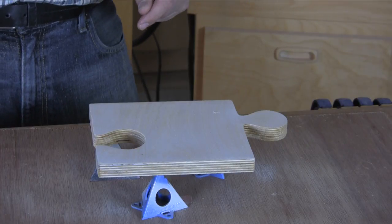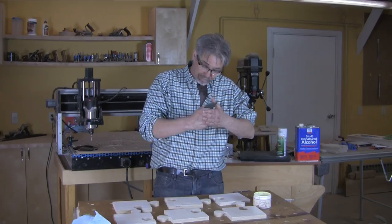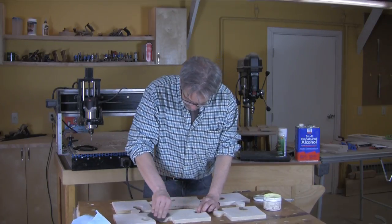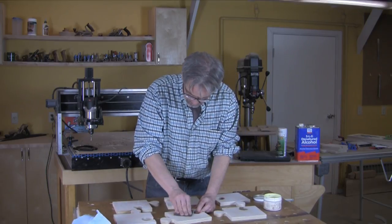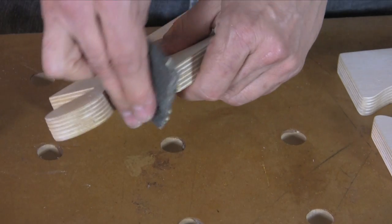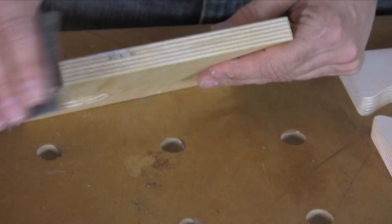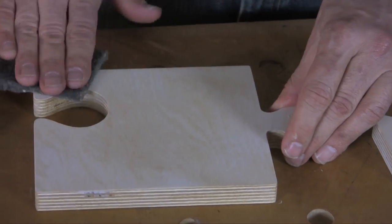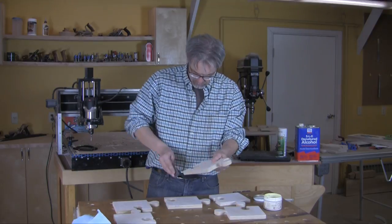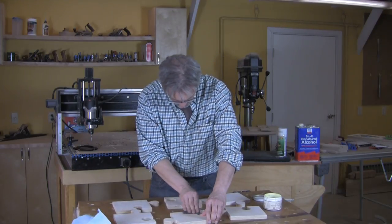It's a great look for this kind of treatment. You need to do one more thing, because what happens if lacquer gets stuck up edge to edge with lacquer? Sometimes it can stick together and weld. I also want to bring out a little bit more of the yellow amber from the shellac, so I want to polish down through that lacquer. To do that, I take an abrasive pad with beeswax on it and apply the beeswax all around, especially on the tabs and edges that will be joined together. That will keep them from welding together if they sit there for a long time. I rub this on and polish it down just a little bit. It also takes off any little nibs in the surface and makes it feel really great.